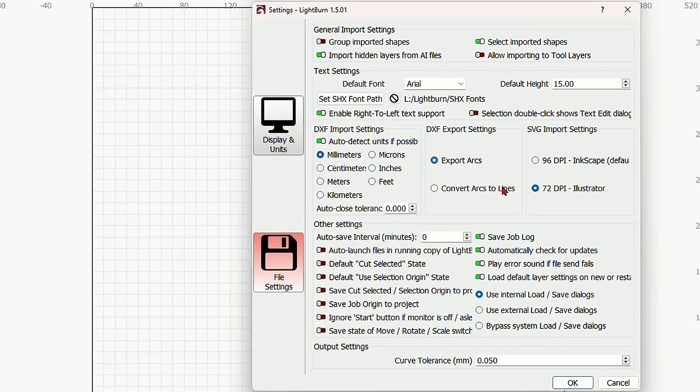One of the benefits of doing it this way is you get a nice brown out of the engraving. So you actually wash off all of the soot and debris. Some people like the black. I like the brown. So I usually do wind up spraying it with water to get the soot out of there. It just depends. On some projects, I want it to be black, and other projects, I want it to be brown. It's just a matter of which you prefer.